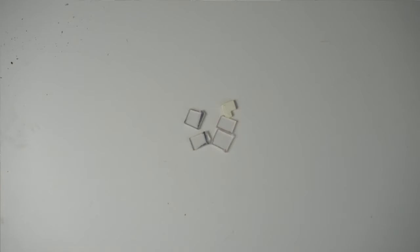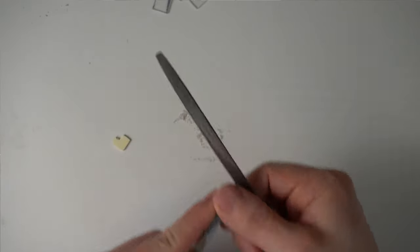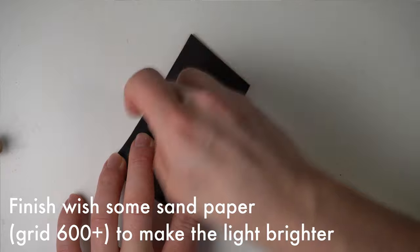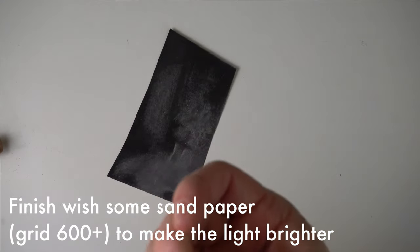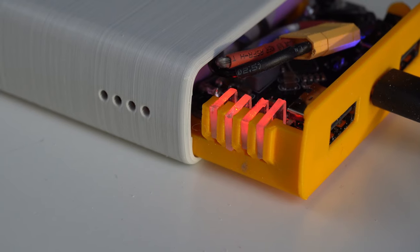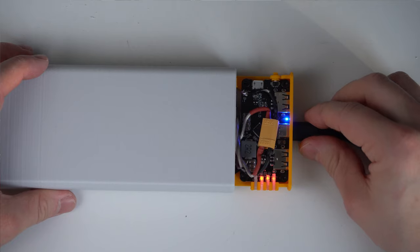As a last touch, we can cut out four pieces of acrylic glass to sit in between the fins flanking the LEDs. You can 3D print a guide and then just file off material from the acrylic glass until everything fits. The guide does not account for the LED itself, so after test fitting, you need to file a little notch into the acrylic glass so the LED sits flush against it.